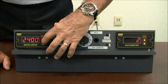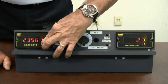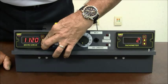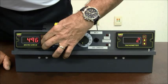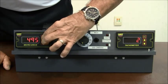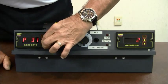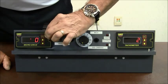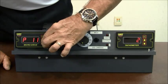Parameter 31 is the motor speed — the known motor speed, either measured or calculated — where I get the 25 feet per minute reading on my conveyor. From our example, that was 500 RPM on the motor, so I put 500 in here and press enter. Now the last thing I need to do is introduce my decimal point, which is parameter 13. I know from my manual that's a value of 3, and press enter.